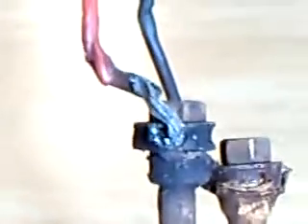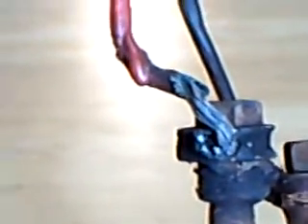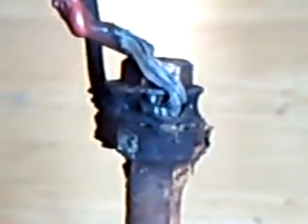This particular cell was inside the vessel here with the water level up to here. And if you look closely at this particular terminal, you can see that the wires have become corroded and the sheathing has melted and pulled away. I've been a little aggressive at yanking it out of the vessel because I knew this was a junk cell.